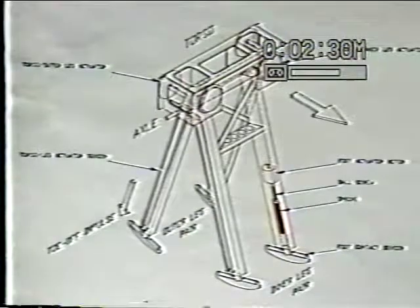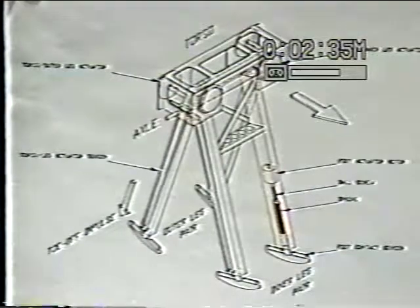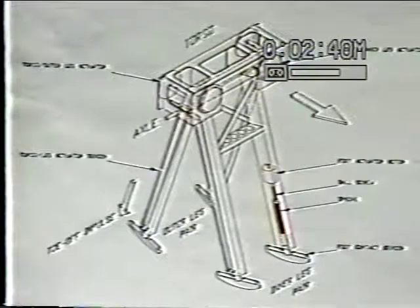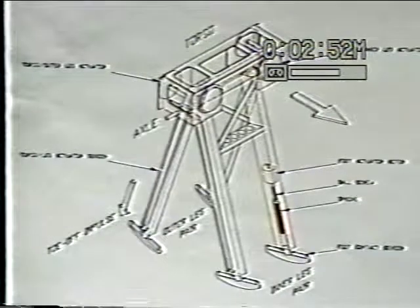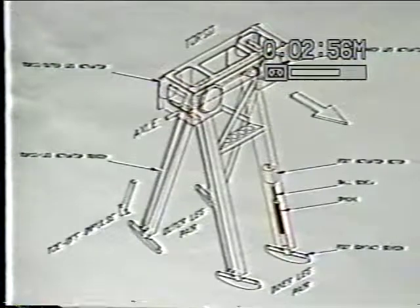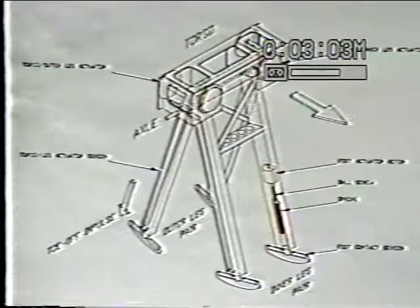The machine will also have a torso — a convenient place for storing equipment, but it presents a new problem. The torso is essentially an inverted pendulum and has to be stabilized on top of the hips. That's done by applying a torque between the torso and the stance leg, and it's quite straightforward to devise an appropriate control law. The problem is actuation — you need an actuator which can provide the necessary torque but at the same time not compromise the leg's freedom to swing, which is absolutely essential for passive walking.